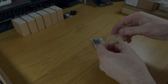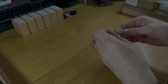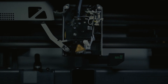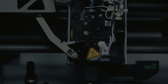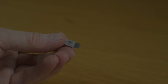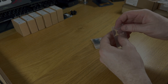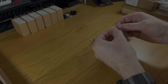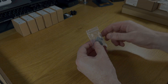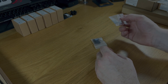These cutters are from the print head — they cut the filament as it's retracting. They do need replacing; they are consumable. Definitely keep a stock of those. I've already replaced one — I had a lot of issues with filament not retracting properly and it turned out the cutter was blunt and wasn't cutting it properly.